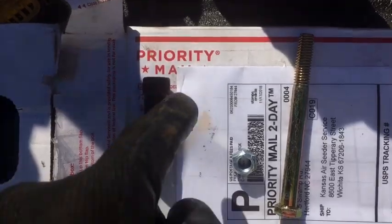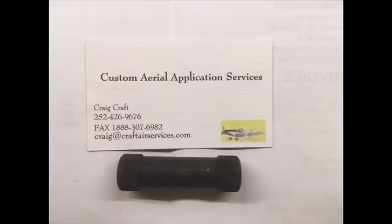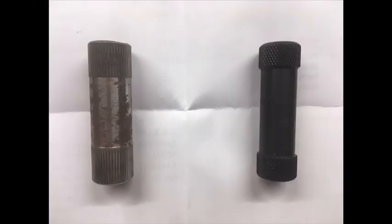Now the basic kit to insert there is, that's a sleeve right there, and it's a 3/8 bolt lock nut. And you see there's anti-seize on that, and you're going to be glad you put anti-seize in the years that come when you have to take those out. So there's 16 of them. I did the back row. And here to the left that's one from Reddy. I really like their products as well. They just didn't happen to make a 750 compatible, which you need that little thinner bone-shaped, or it's just going to be too thick where you won't be able to line up the bolt.